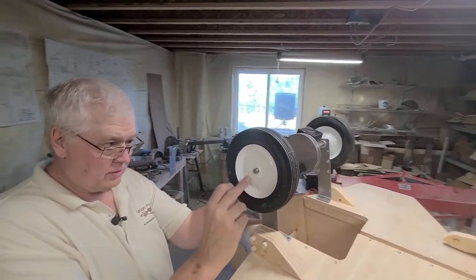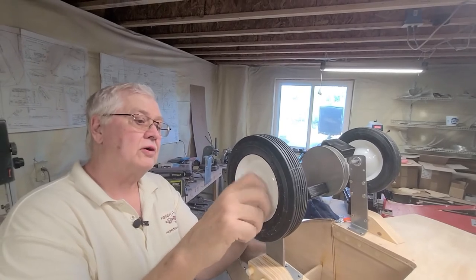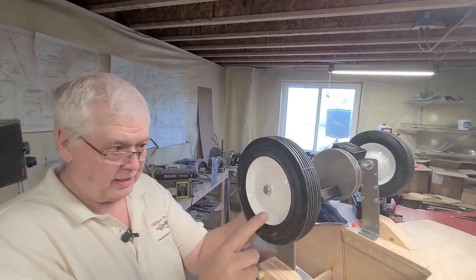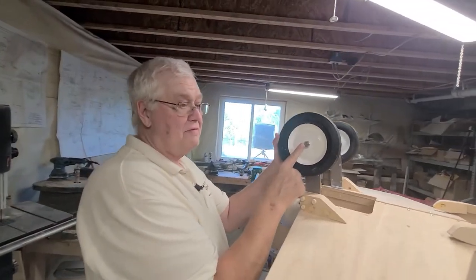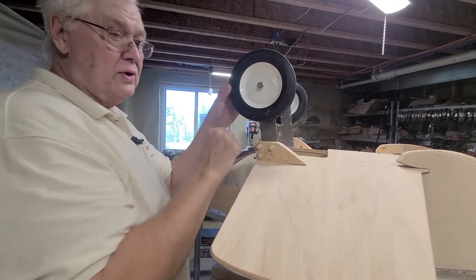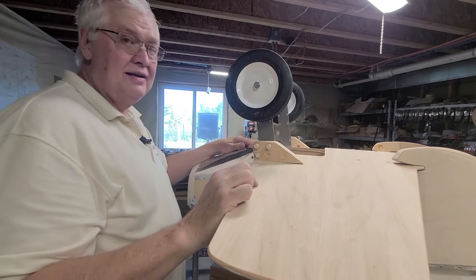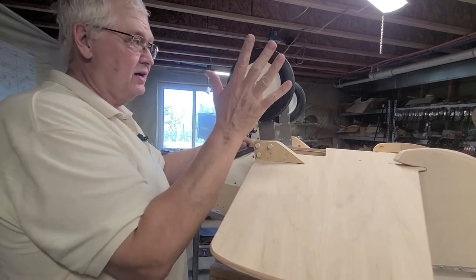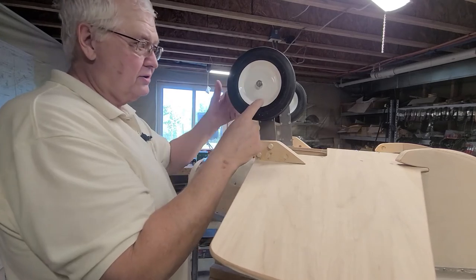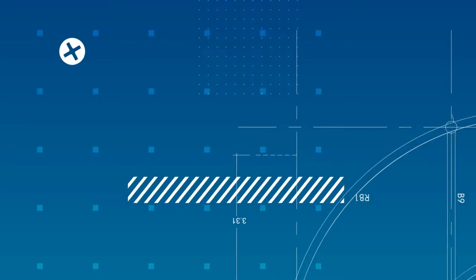On the drive wheel, the one with the nut, you take another jam nut and screw under so that jam nut is flush with your axle, your pedal crank. You tighten this jam nut very, very tight, about 45 foot-pounds of torque against your wheel. That's your pedal crank wheel assembly put on. The only thing you don't have is your hubcap. You have a ring here. You put three screws in to your wheel. Put your hubcap on. That's the end of that.